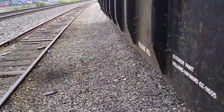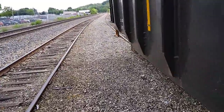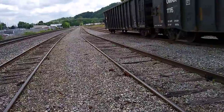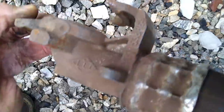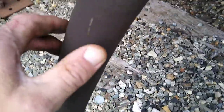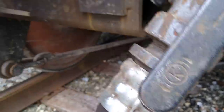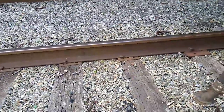Usually when they go into emergency it's because the little rubber gasket has broken and air is escaping, causing lower pressure. If you look, you'll see the rubber gasket — that little circle — usually they go bad. Sometimes there'll be a split, hole, rupture, or the seal has given away. The locomotive carries extra hoses and a wrench to come out and fix it.